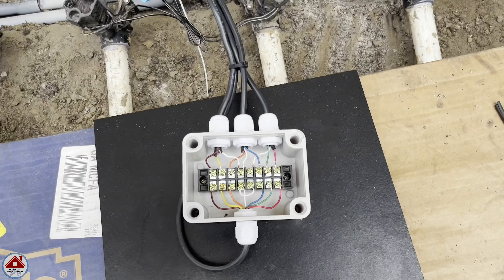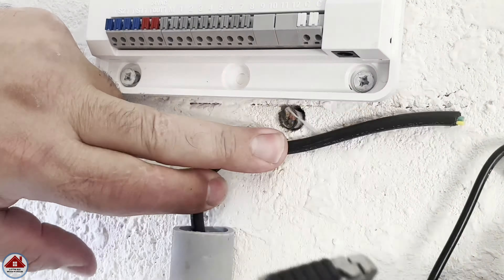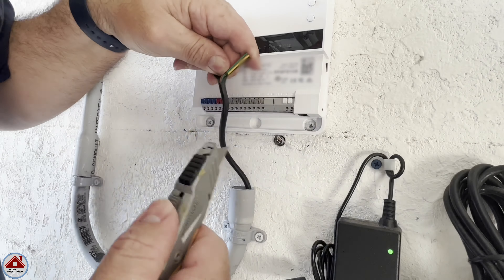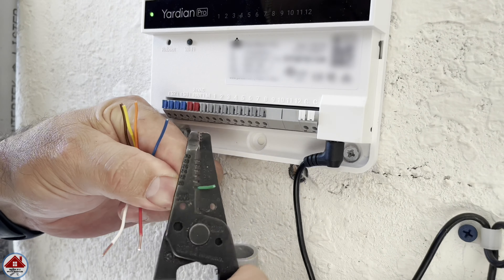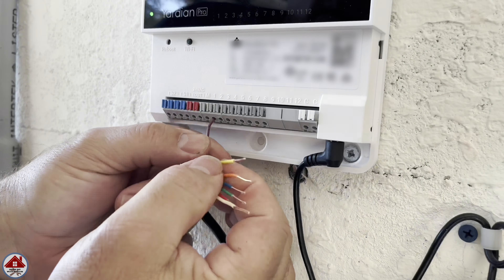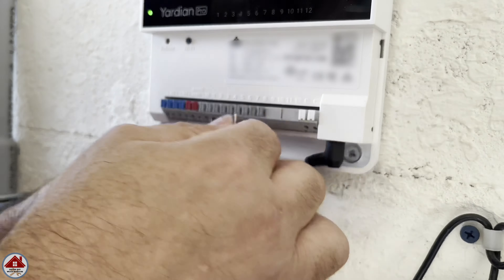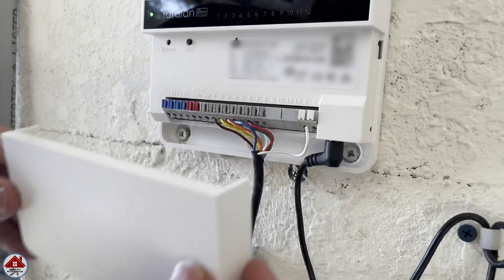Okay, let's go wire up the controller. I start by cutting the old wire flush with the wall, then push the wire back into the 90s in case I need to pull some back out. I cut open the jacket and peel it to my desired length — it's decently thick so I just keep working at it and cut the excess off. Next I strip all the individual wires. If you want to see how I installed this smart sprinkler controller and all its features, I have that video on my channel. Now to wire it up: this is easy — you just push the correct color wire into the corresponding number terminal, and the white common wire gets pushed into the terminal labeled C. And that's it — I put the cover back on.